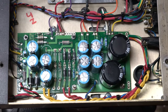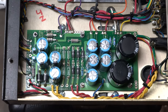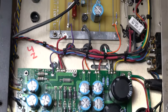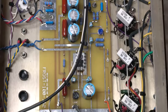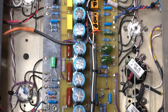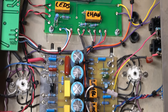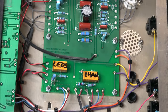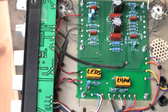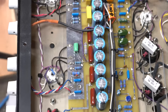I'm going to try and do a handheld slide across. This is that main power filtering section I mentioned. Hopefully you can see the bridge rectification happening there, with some heavy filtering. That was a section we saw from the other angle — the power section and all of these filter capacitors, as well as all of the tone shaping. And then down to a relay board. This is more the input section — they've got a little bit of a smaller board that you can't quite see here, but I'm not going to be taking it apart because this is a customer's amp. At least we can get a little view of what a Fuchs looks like on the inside.